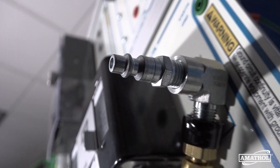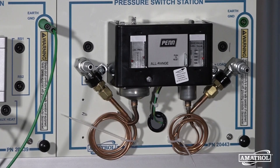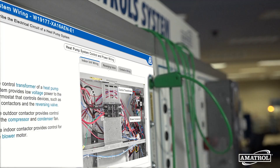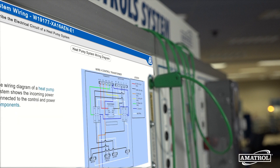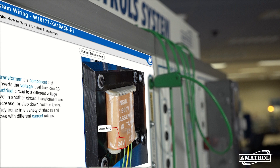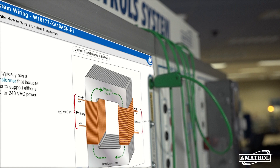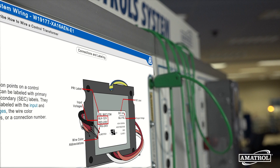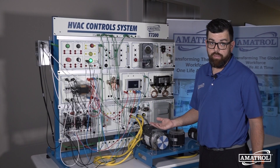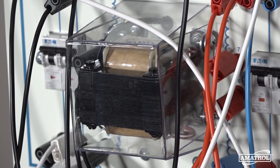It has an air hookup to a dual pressure switch, which will allow us to simulate refrigeration on this system. It's going to have 13 modules that, along with hands-on skills, cover core competencies such as electrical safety, basic wiring, schematics, multifunction and defrost timers, thermostats and temperature controllers, fan and blower motors, compressor motors, basic refrigeration control circuits, residential HVAC circuits, as well as commercial HVAC circuits.